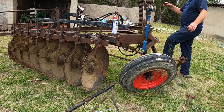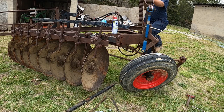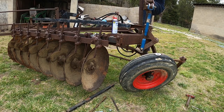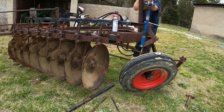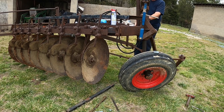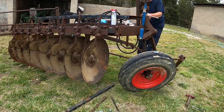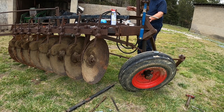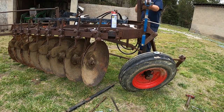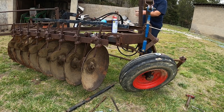I don't really know if you can see that in the camera or not, but the handle's up here. You just pull it and you can see the body of the plow raise up. So like that would be the top — that's about how it was sitting before. Now I've still got to go in the back and run the adjustment up there. But with the back all the way down, if I let this completely down, then that puts my disc back where everything's level.